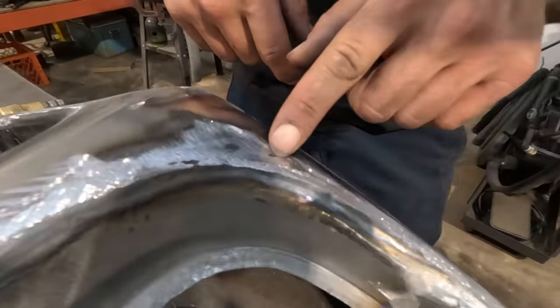When picking a hammer to planish with, it can be dead flat, but you want as shallow of a hammer as possible. The higher the crown, the smaller the contact patch and the more powerful it hits, which means the higher the crown, the more likely it is to stretch. So a flatter hammer is usually a planishing hammer because it can cover a little bit more surface area at once. If you have a shape that's close to what it needs to be on the panel, and a hammer and dolly close to that shape sandwiching the material, it's covering more surface area and smoothing out more bumps at once.